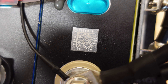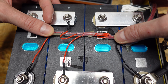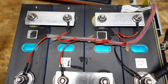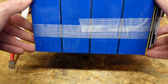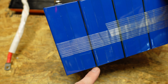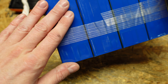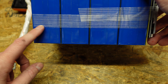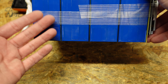The cells all have their original QR codes, though I don't personally recognize what type these are off hand. I don't see any sign of corrosion, leakage, or anything like that on the vents — these cells appear to be perfect. From the top and side profile, the cells are nicely lined up and perfectly flat, with no bulging. They have a layer of insulative fish paper in between each cell, which I like to see. They also have one piece of strapping tape going the whole way around the pack to hold it together — not compressing it, just fixing the cells in place.